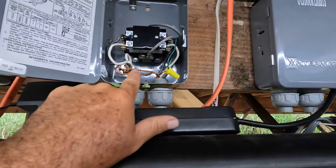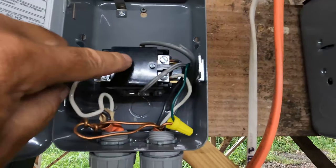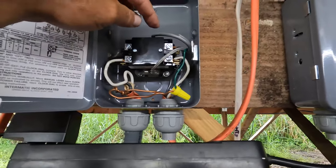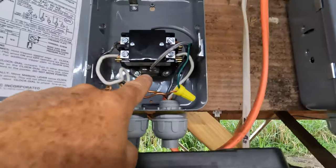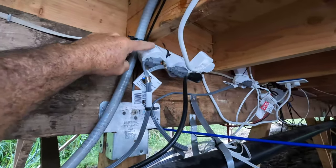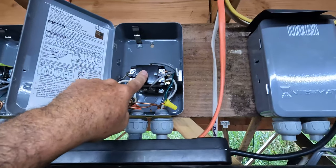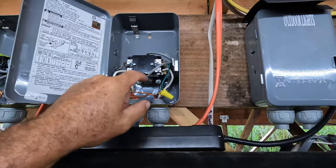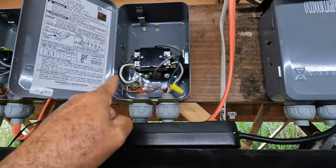You only use the two wires from the plug — neutral and hot — not the ground wire, though the ground can be connected for grounding purposes. There is no grounding connection to the relay itself. You plug the neutral and hot into the top and bottom terminals of the relay coil. When you turn on the smart plug, it energizes the 120 volt coil, which opens or closes the contact, turning the hot water heater on or off.